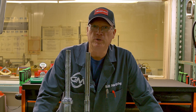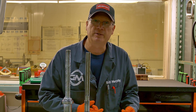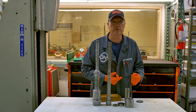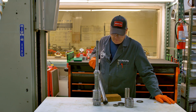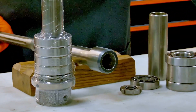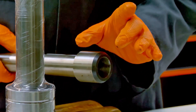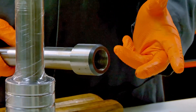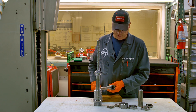You know you have a problem on your knee mill if you've got bearing noise in your spindle, or you're starting to measure each cutter to see if it's going to cut to size. Usually the problem is not the cutter — they're very well made. It's the taper inside that spindle. If you don't have this taper running out close, you can't cut a thou. When a taper wears, it starts wearing down and leaves a high spot in the middle and then it'll rock, and your cutters will rock. You won't notice it, but it shows up when you've blown it. We use Prussian blue to check those.